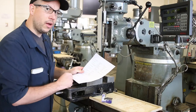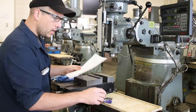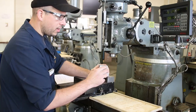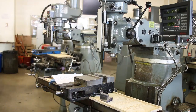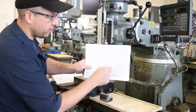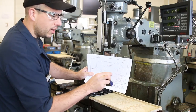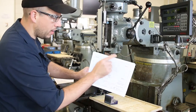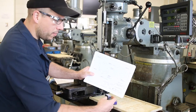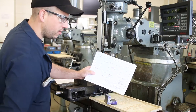If you're following along in your project planning worksheet, we are on step number 15 right now, which is where we rough out this surface — what we're calling surface F. Remember that those are labeled on sheet four of the print, which tells you what all the different surfaces are, because at this point it gets difficult to identify all the surfaces relative to one another. So surface F is this one back here — that's the one where it's going to end up being 500 thousandths thick, the shorter of the two inside surfaces.